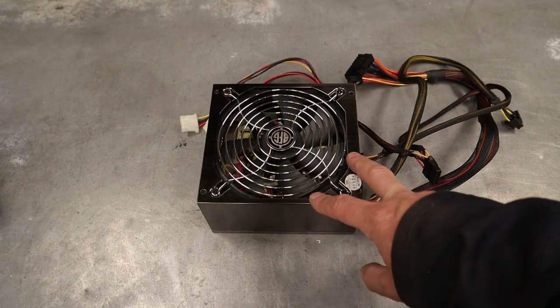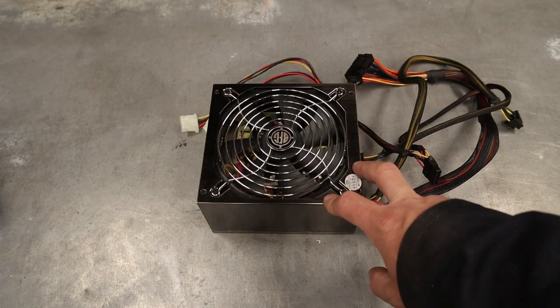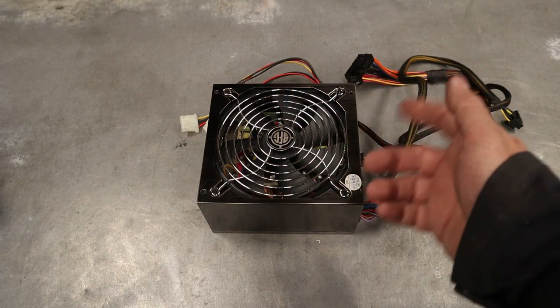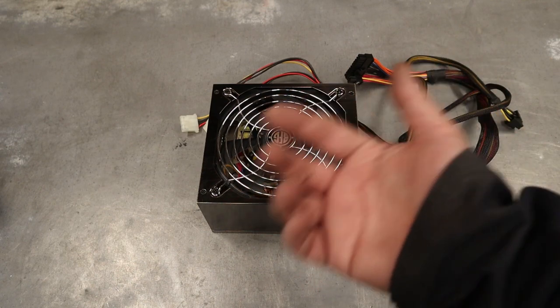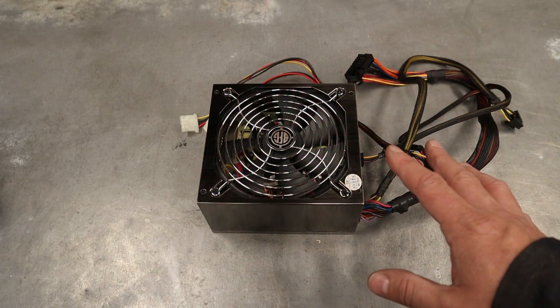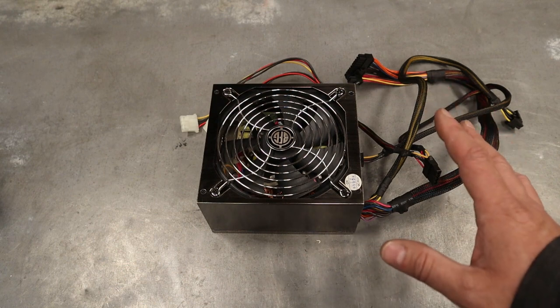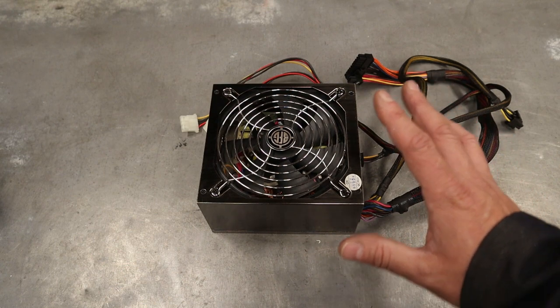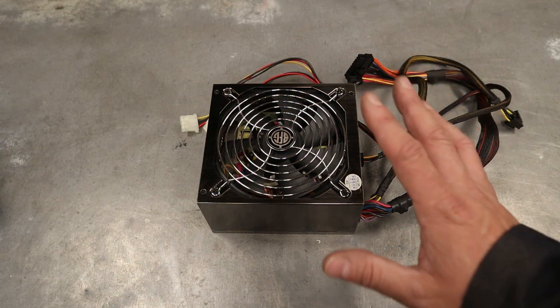Last up is an ATX power supply like you would find inside the computer. Now, because it's the same exact thing, some people might decide, well, I'm going to tap into the 12 volt line on that one and just use the one power supply. I strongly suggest that you don't do that for a whole bunch of reasons. First one, your pinball cabinet needs every watt of power it's already getting just to drive the computer and your programs, so don't do that.